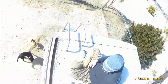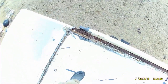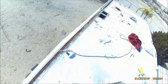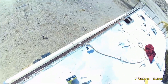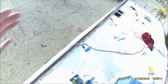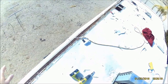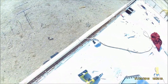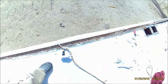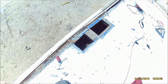Let me explain a little bit about the roof. We've got these Z channels right here that are all rusted out. We're going to do something a little unconventional by getting rid of the Z channel and ripping two-by-fours all the way down, so we're actually building an inside cap. Once we put the rubber sheeting over that, it should in theory be waterproof. We're getting rid of all this metal roofing and applying rubber roofing with some more metal, trying to do a cost-effective way yet have a very good product.